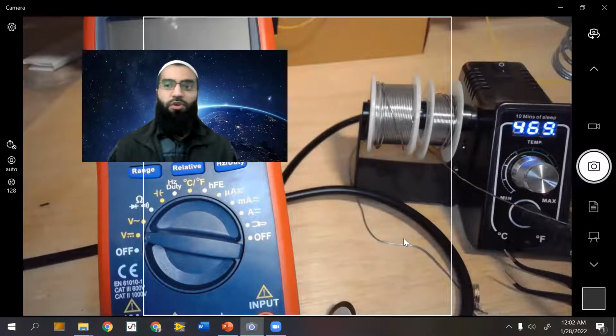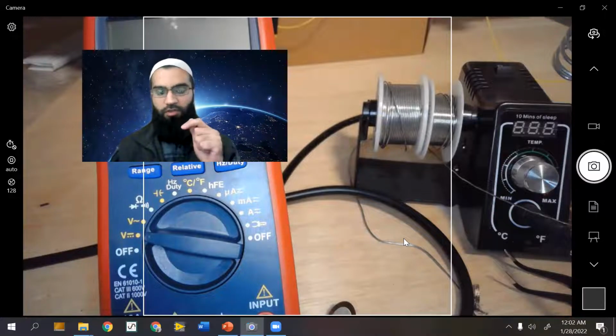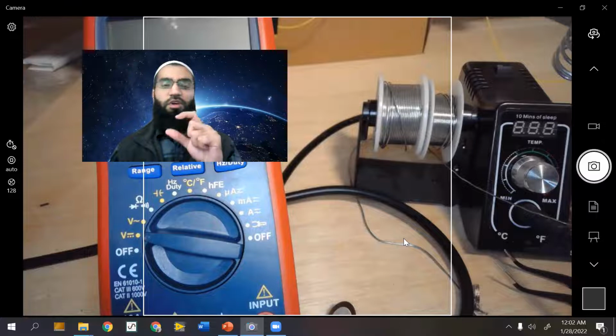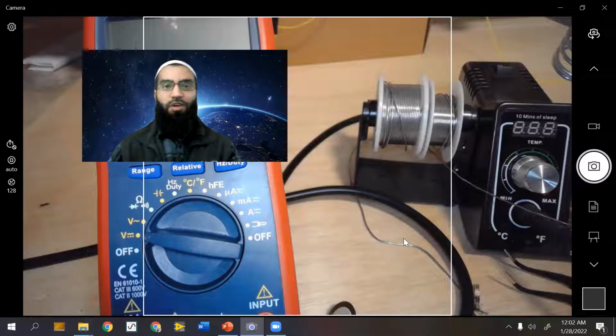As the polarization decreases with temperature, you have charges appearing, and that's going to create the charges that you see. So you heat the piezo ceramic, the positive voltage side is going to have a dot. And obviously, if you get negative voltage, you just switch them. You already know there's going to be a dot on the negative side. And the same is true for applying pressure. If you apply compressive pressure to the piezo ceramic, you'll get a positive voltage on the side where there's a dot. Basically, where you had applied positive poling voltage when creating the polarization, inducing the net polarization in the ceramic.